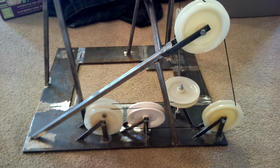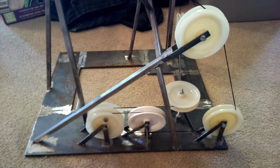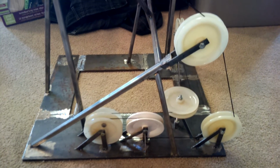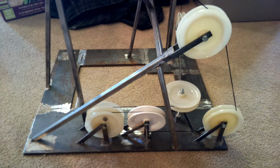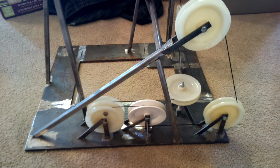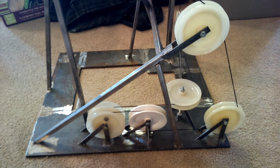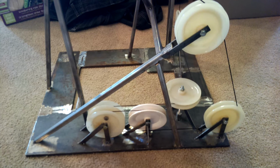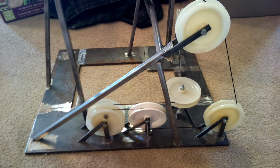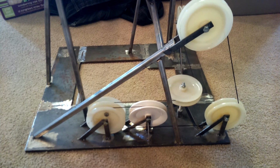A standard aerial tram has two cabins. One goes up while the other one goes down. They meet around the halfway point, and the cabins themselves act as counterweights to each other. So if you're hauling 100 people uphill and 0 people downhill, you're actually only hauling the weight of the people, because the tram cabin offsets the weight of the other cabin.